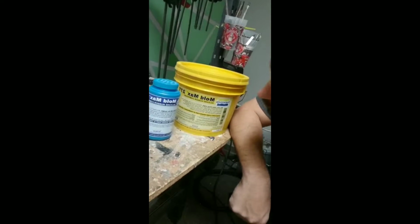These parts are what you'd call master patterns, meaning that they are prints that I'm curing just to sand smooth and then cast with a silicone rubber. And it's important that the detail's really good because the molds will pick up everything. So I'm just curing it just enough that I can sand the parts nice and smooth, and then I'll start pouring some mold. Using Mold Max 27T.